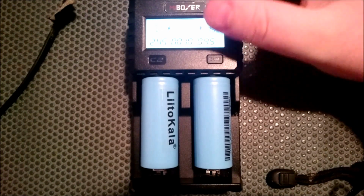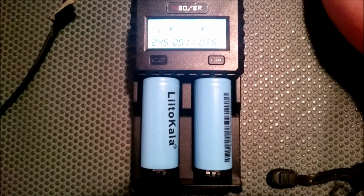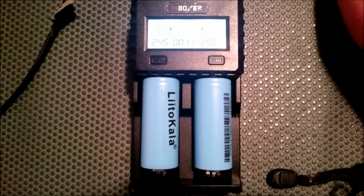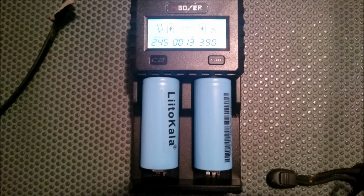Basically, if you got a battery that has a safety trip, it will reactivate it. It's not going to activate lithium ions that are at exactly 0 volts. If the safety tripped, it does read as 0 volts, but obviously it's not actually 0 volts. The cell should still be well above 2 volts, usually about 3 volts, and the protection trips on a cell with a safety mechanism.